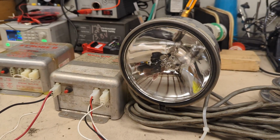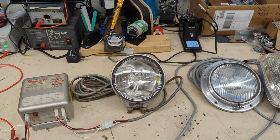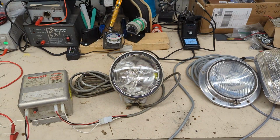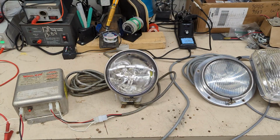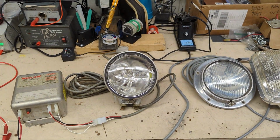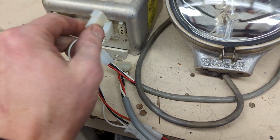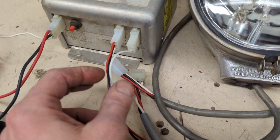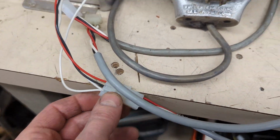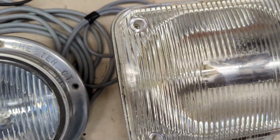So here, if you do combine that trigger wire like we see and plug the same single strobe light head into both outlets of the power supply, you do end up getting the 120 flashes per minute double flash, and it doesn't really cause any significant problems. There's a little bit of extra heat, but very survivable, very usable. Would it look cleaner to be done inside? Yes, it probably would. I've never seen a power supply where it was combined inside. That doesn't mean it doesn't exist.